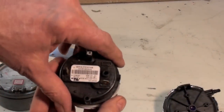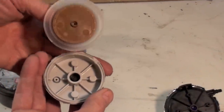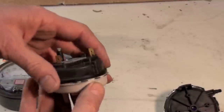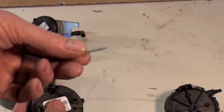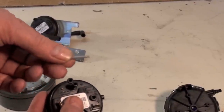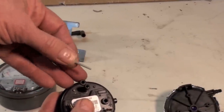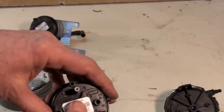Here's one that's a little bit different. It's made out of plastic instead of metal, but it has pretty much the same type of diaphragm — very thin. This one has a little something extra in it that you'll see in a lot of these. It's designed to eliminate the pulsing that comes from the inducer. This should not be removed, as it tends to lower the life and maybe make the switch erratic. It should always be left in there; of course, if it's plugged it would have to be cleaned.